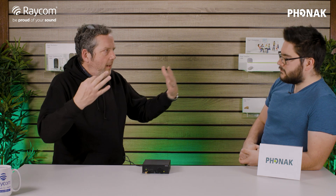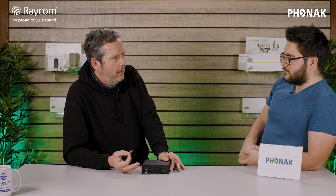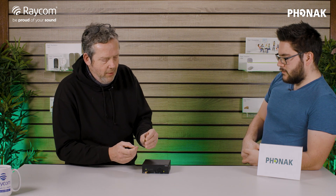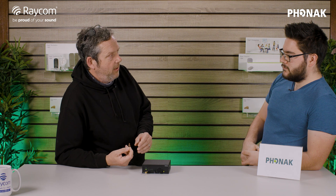In a studio scenario you've got a lot of lighting, metalwork, and cabling around, with the signal bouncing everywhere. I would expect a Roger base station and an earpiece to be up to 40 meters apart and be quite happy. The new version — the Roger earpiece V2 — actually achieves much better range again, with an extra 30 to 40 percent more range. The unit being shown here is a V1, which you can identify because the writing on the front is white; the V2 has blue writing.